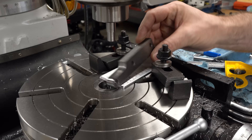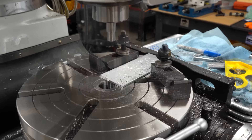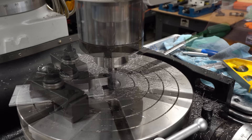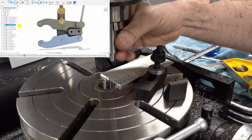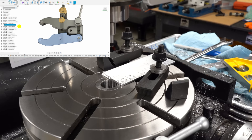Just look at that — I could not be happier. The second arm is exactly the same except the hole diameter is a little different. I was really curious to see how accurately placed these holes were since they're just drilled and reamed, but the wall thickness is really consistent — well under a thousandth of an inch variation.